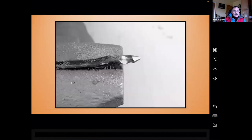Now, I find it useful. You can certainly lock this thing in the vise and just do a little bit. I find it more useful to close the vise to, I don't know, a 3/16 of a gap between the jaws, and then just rest the round on top. And you can then turn the bar as you're filing because you've got the handle on the other end, and it works quite well. Your call. It's up to you what you do.